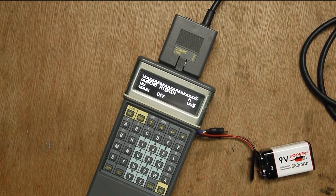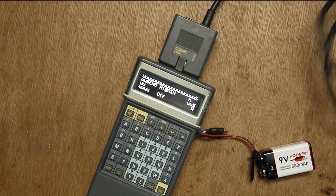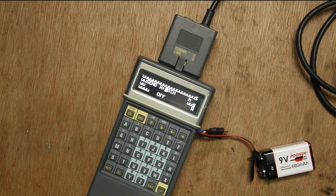And we can set up one of the PIOs in the Raspberry Pi to generate a UART signal. So we can send and receive on any pins using effectively programmable hardware in that chip. So that should work, and that means the comms link, there's a good chance of that working once I do a bit of code and verify the hardware.